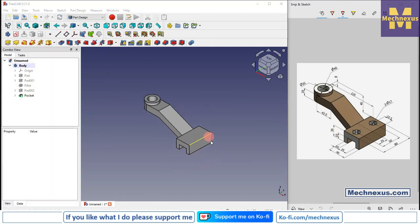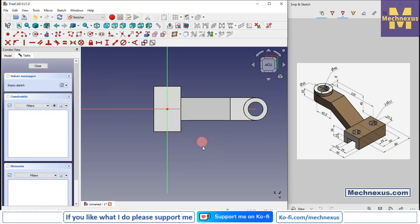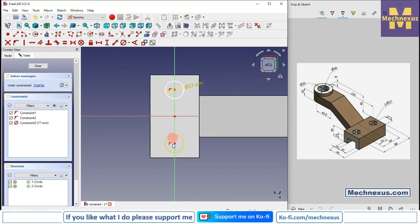And now we will create these two holes. Select the top face and click on the sketch, and we will create two circles, one here and one here. This is of diameter 17, so we will select diameter and give it 17, and we will make it symmetric. So we will click on symmetry, select this center and this axis, and here is a conflict, we will delete it. Now we will select the vertical dimension.